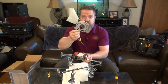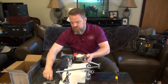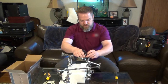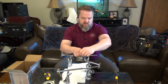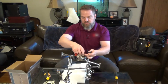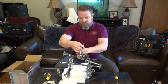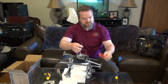This is that universal mounting plate right here, and right here is the ground screw. And there's usually going to be a whole bunch of wires all tangled in here, and once you get them all tangled, you realize that there's only going to be 3 that you actually need, because most of the wires are internal to the system, the fixture itself. So now that I got everything loose, I can shove all these back in. I've got some of the accessories right here, the wing nuts and the wire nuts and stuff.